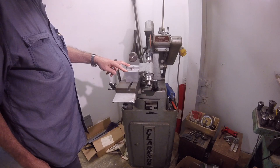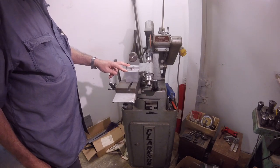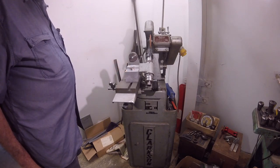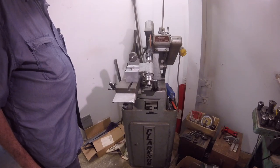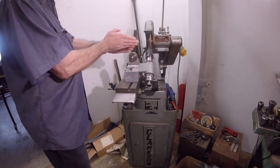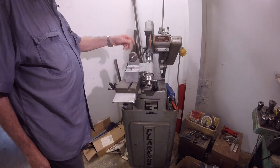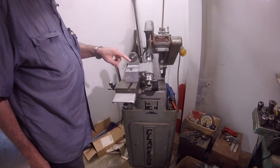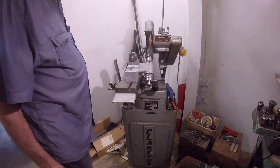I have a bolt here that came with the machine and I had no idea what it was for — it's just not mentioned in the makers' leaflets or the manuals. But I got onto a site on YouTube called Garage of Tools, and he too has the same model, Clarkson Grinder. He gave a demonstration that instead of having the axis of the workhead at 90 degrees of the table, as you do with this riser bolt — there's no swivel on the bottom — you use this bolt here to offset the workhead from the table, and it just makes all the difference in the world.